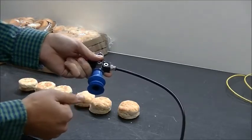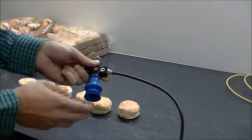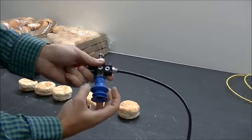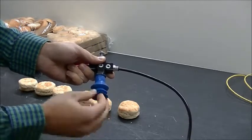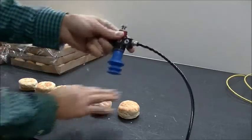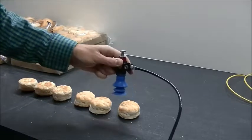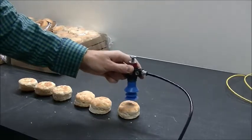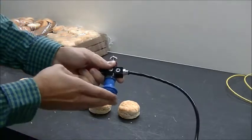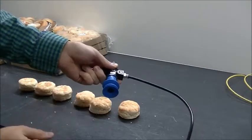It's a 35 mil cup made of food-grade silicone with a double bellow. A nice thing about this double bellow — being smaller in the middle than the outer piece with a thin flexible lip — is that the compression requires very light force, so you're not damaging the surface of the biscuit as you come down. A traditional bellow cup might take more force and won't absorb shock as well. The bellow contracts into itself, giving some nice stability to the cup.